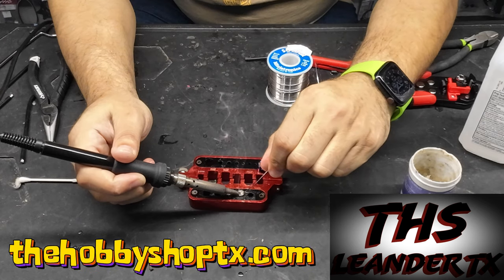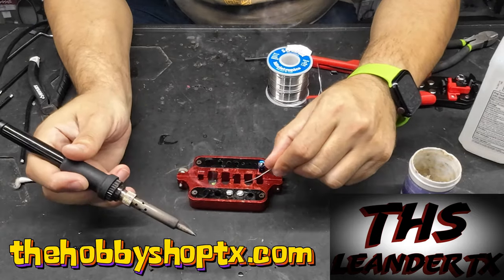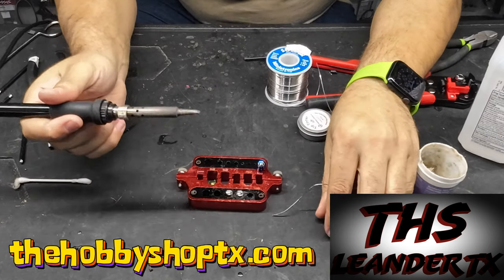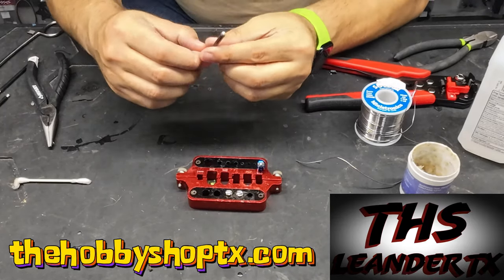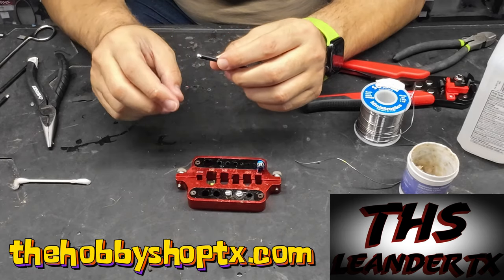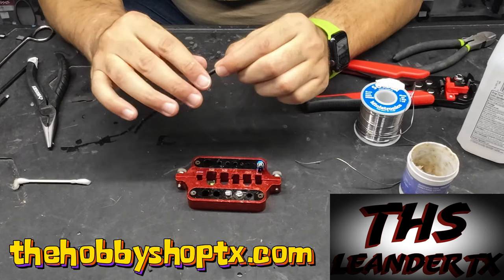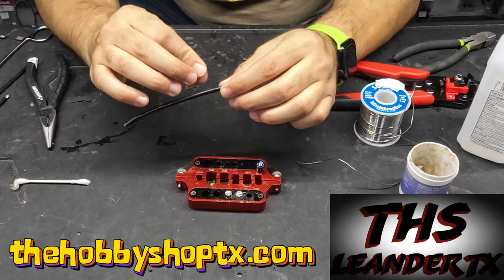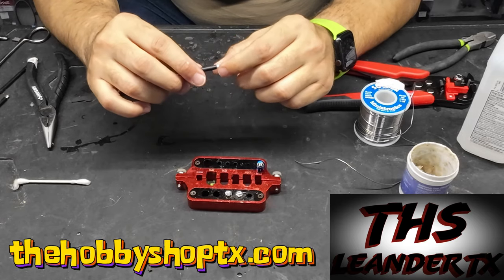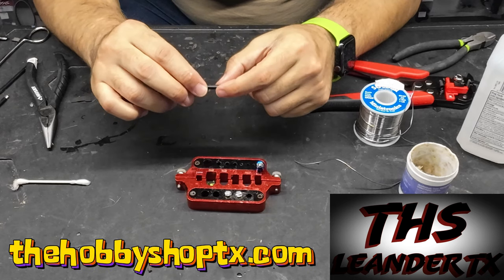You can have solder pool inside the cup — that's fine. On that edge you want it to be pretty clean and very thin. Next is your wire. Typically when you solder you want to tin the first material and then tin the second material. This time around I'm not going to tin the wire, because when you tin the wire you're actually strengthening the fibers — when the solder hardens it becomes a solid mass. That solder will run back even where it's sheathed, so it'll be less flexible. We really do want this tip to be flexible.